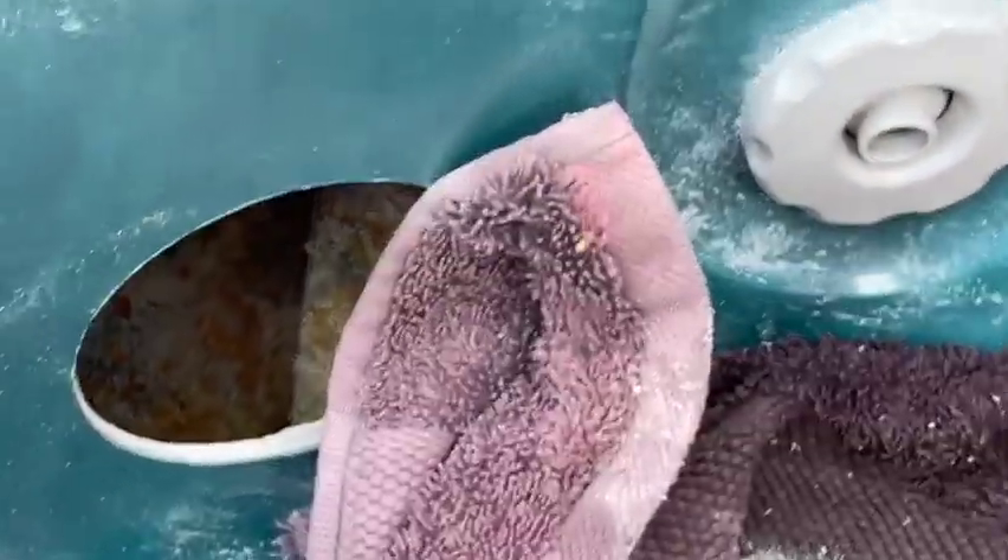The next stage — make sure there are no burrs left on the hole or on the back, and give it a wipe. If you get in there with a towel you'll find a lot more little bits of insulation come off, which gives you a much better sealing surface back onto the fiberglass on the back of the shell. Give it all a wipe. I'm going to get this last bit of water out too — I don't want mess in here. Get all the mess from the drill and the water that came in from a rainstorm out, get it all clean, and then we'll start siliconing.